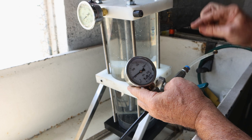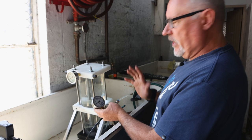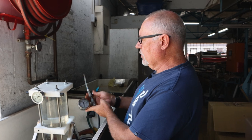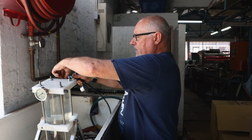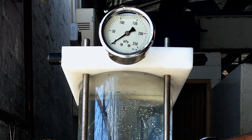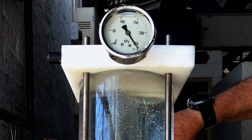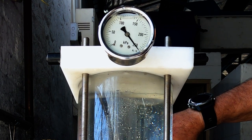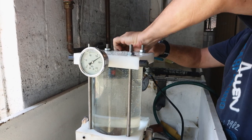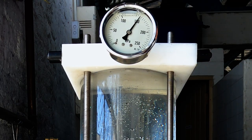I'm not going to be putting five bar into here — we're only going to go up to about two and a half bar, and we will use the device at about two bar, which is equivalent to 20 meters. If something's going to fail it'll generally fail in the first few meters, but we will take them down to 20 meters. So now I'm going to connect that to the tank — it's at zero pressure now. I'll slowly take it up to two and a half bar. A little bit over there — there is a slight leak but that's going back through the valve itself.